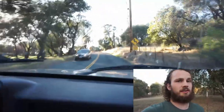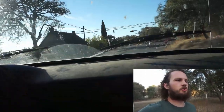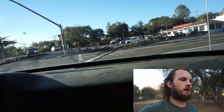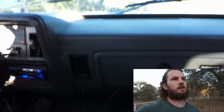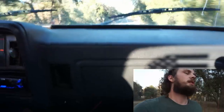So we're going to inspect the connections on the intercooler. Also the intercooler itself. At some point we're gonna get in there and do a leak test on it, pressurize the entire system, and see where our boost leak is coming from, because this HX35 turbo should be hitting 35 PSI all day long. We've tried it wastegate locked open, locked closed, the reference boost line for the wastegate capped off. Doesn't matter, we're stuck at 15 PSI. And I know for a fact this turbo should scream right past that. I'm hearing anywhere from 30 to 35 PSI is what you can see from this turbo without an issue. So, need to fix that first.